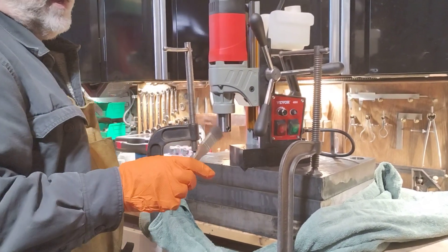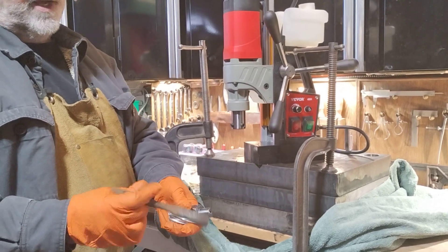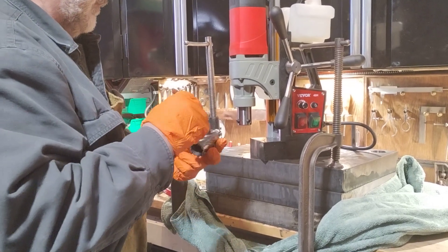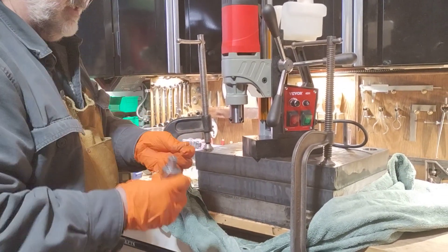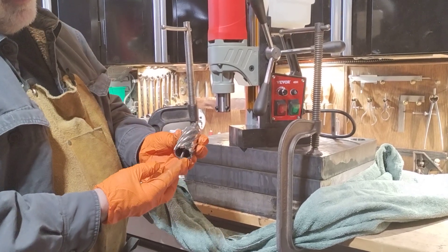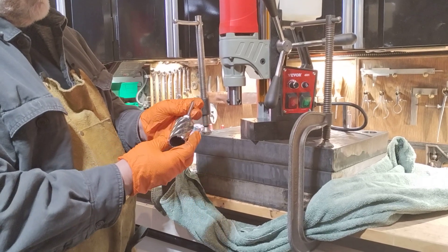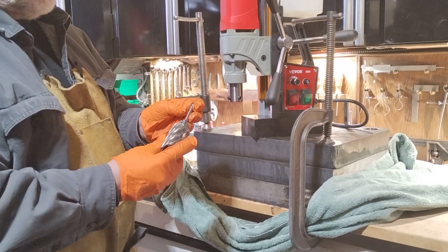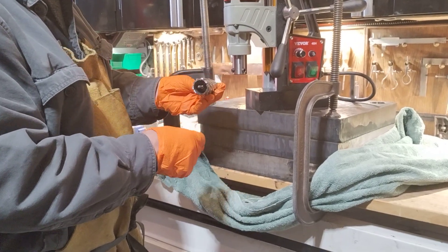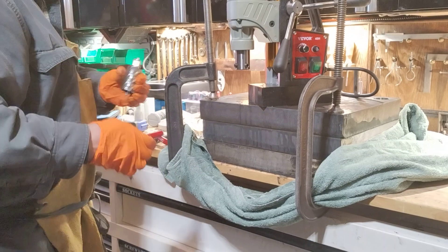Here's a quick side tip: if you take a paint brush and just cut it off with scissors, it makes stiffer bristles for cleaning chips. So anyway, this slides through here — there's a spring inside here. This thing will move up and down, but it maxes out before you even get to two inches deep. So you have to cut your hole partways, then pull the pilot thing out after it started, and then get back to drilling your hole.